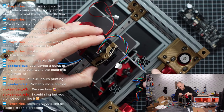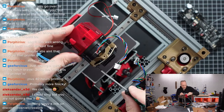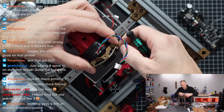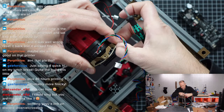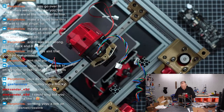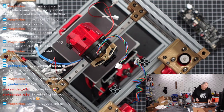It's very much too short, if you ask me, this distance here. The screws are slightly too short. I mean, no, it doesn't matter. But I think from the specifications from Voron's side, the M3x12, we have plenty of space. The whole thread in the distance piece is much longer, so there's no problem if we just use a longer screw. But having that kind of very short range for the screw to go in, I have no trust that this is going to be holding very nicely.